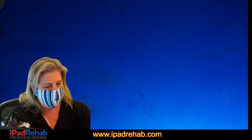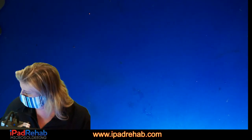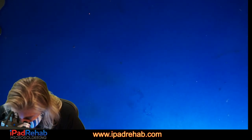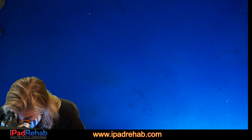We shouldn't have a leak of 100 milliamps before prompt to boot, and a leak of 100 milliamps is probably going to cause a serious problem for it to be able to maintain the voltages that it needs to operate here. What could that be? If we don't find out with this, then we're going to have to start going around doing voltage testing to see if we can find a missing voltage. But the problem with water damage usually is where the water goes.